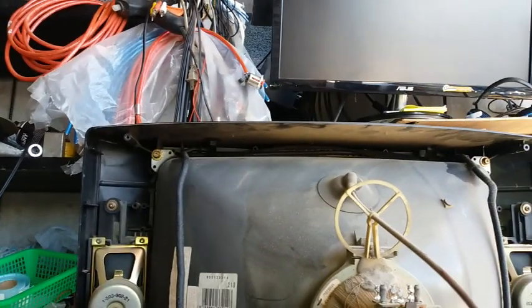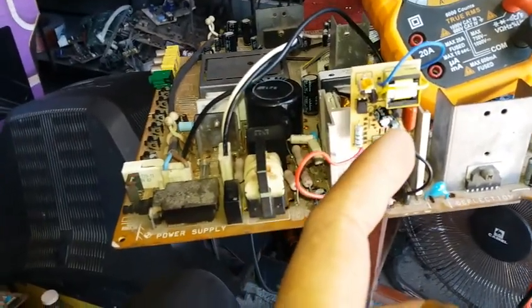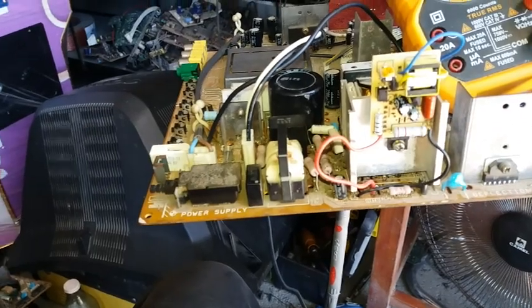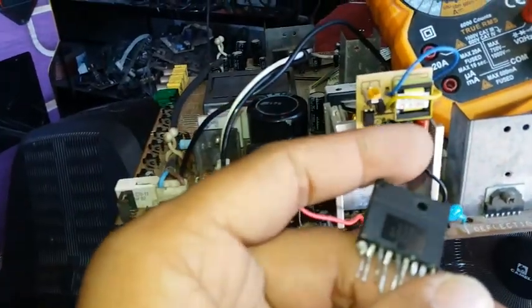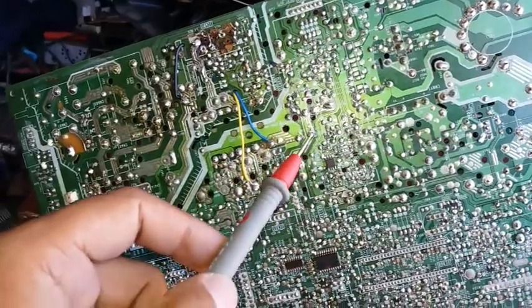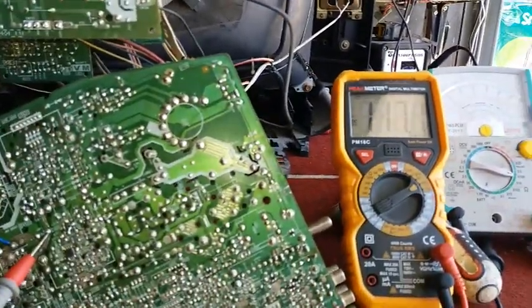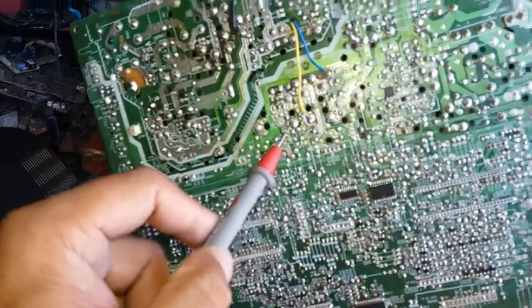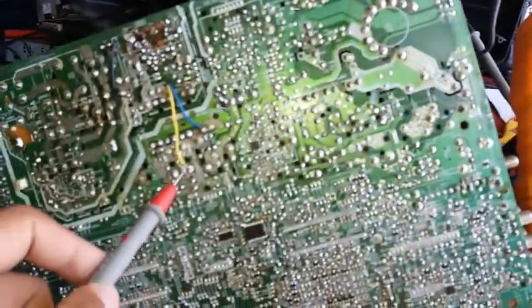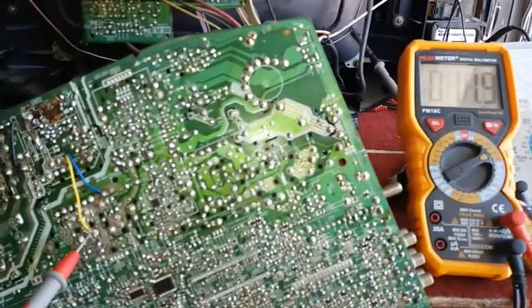As I can see in my mirror, it's already oscillating. This 4-wire module is very useful, especially when you can't find a replacement regulator like this one. The B-plus reads 117 volts — it should be 120. This rail reads 16.5 volts — it should be 16. And this one is 11.8 volts — it should be 12. I think it's good!